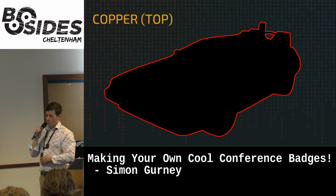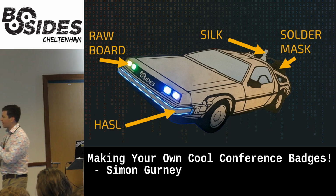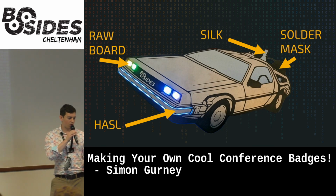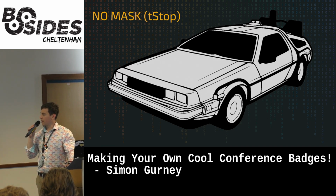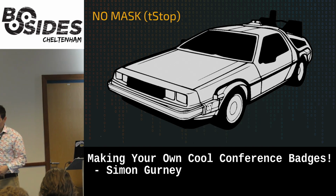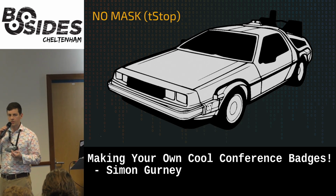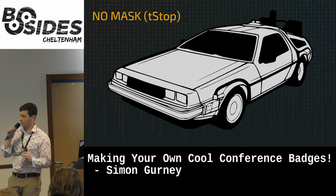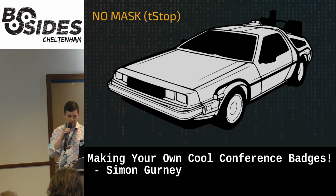So in this case, the full board was designated as being a copper fill. And then actually all we care about is not having copper in these little bits, so we can shine through. So we've got copper everywhere. And then we've got the bit where we don't want solder mask. So this is a bit of an annoying one. The solder mask one is an exclusion. Everywhere we have silver, we don't want the solder mask, otherwise the whole board would be black. You want the silver to show through, so we need to take the solder mask off. So all that bit there goes onto a layer that tells it not to put solder mask there.